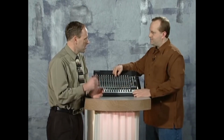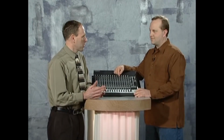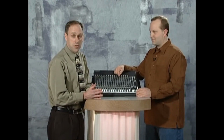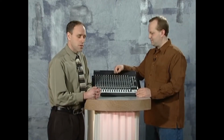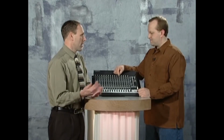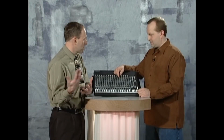If I can interject here, in personal experience, I've found that vocalists really need a lot of keyboard or piano. They mainly need that to stay on pitch. And if they're background vocalists and there's a main vocalist, they need quite a bit of the main vocalist to make sure they can cut off together and all of those things. So by doing that, I can turn the piano up really hot in the monitor mix while I keep it at its properly mixed level in the main speaker system.